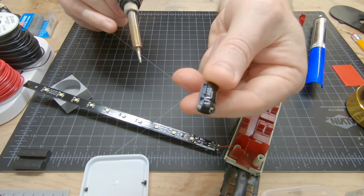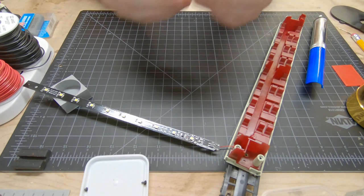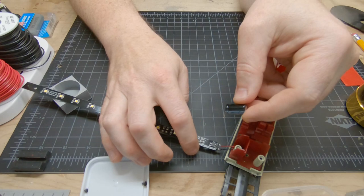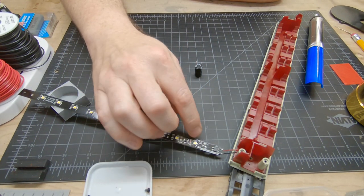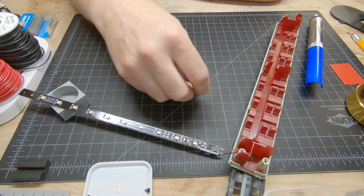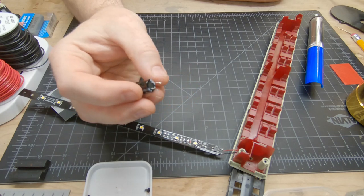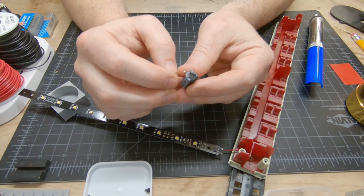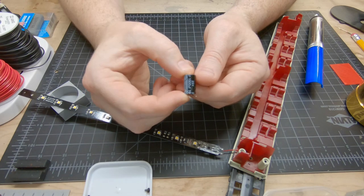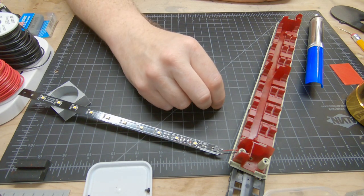Here we go - so we've got the capacitor out, so we're in a little bit of a better shape. The capacitor has this gray stripe down the end and this denotes the negative side, and it came out on the negative side of the board. So we're just going to use a black wire that we're going to solder back onto the negative side and a red wire onto the positive side. I did cheat a little - I did buy additional capacitors and made sure they fit in there before I started playing with the board.